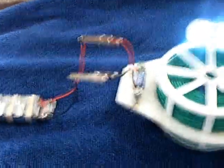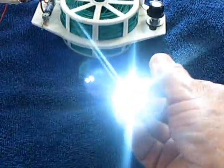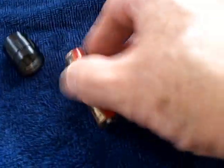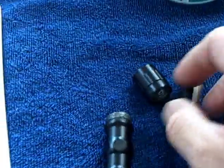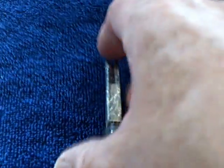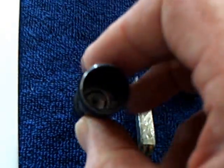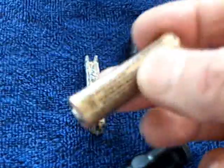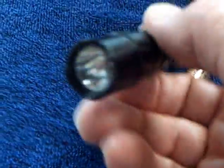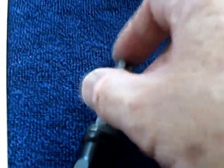After I did that project, I got to thinking about making a AA battery version that would fit in this little flashlight I use on the boat or around the house that just uses a AA battery. I built some small versions that would be the size of a AA battery to fit in this flashlight. I dug those out and charged them up using the little solar charger that I made here, and they still work. That's the one that fit in the flashlight — I got it wet and then charged it up with solar energy. This flashlight does not have button cells in it. Some people when I first did this video thought it was one of those three button cell batteries, but it runs on a AA. It's got a voltage booster circuit in there — it's a one watt, one LED, one AA battery flashlight.